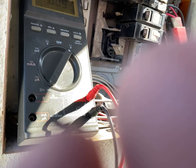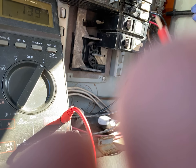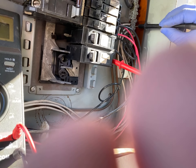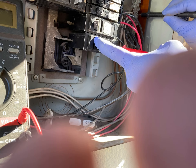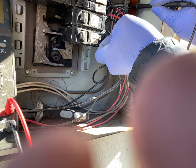I'm going to take this lead and put it to the ground, and put this one on this side. Notice that it should get me close to 120 — 123 volts. That means I'm having electricity going across. If I shut this down, electricity will stop flowing — no more current, going to 0.0. Turn it back on, and you have electricity.